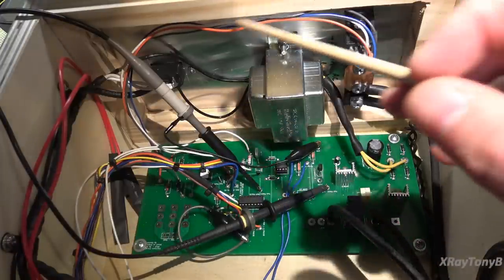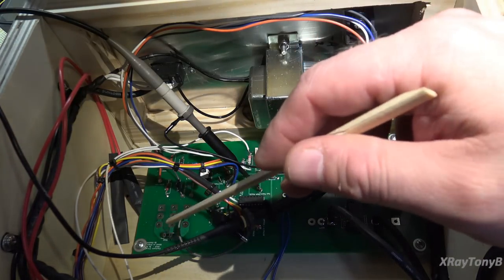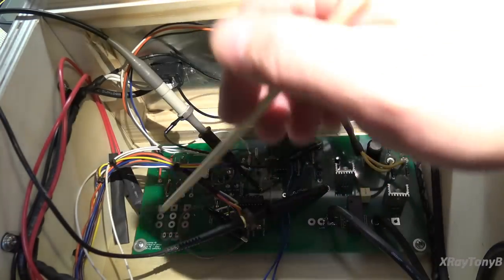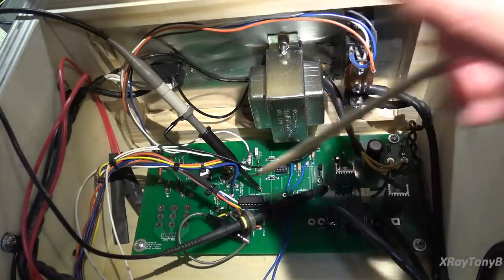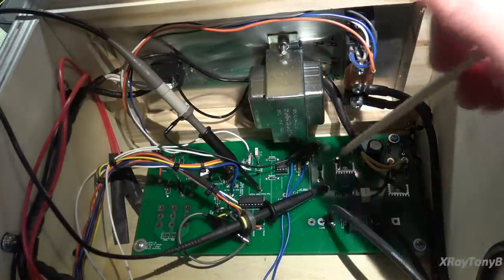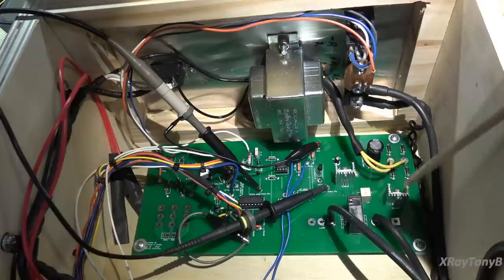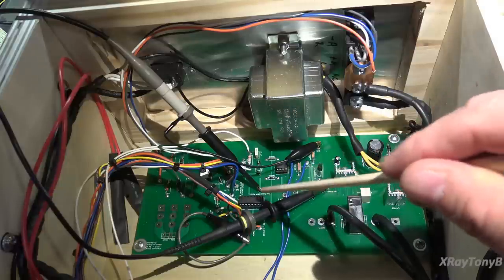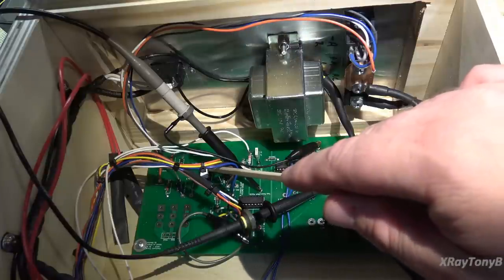These are the signal wires going back to the logic board. I modified this logic board — the latest revision is a little different yet to accommodate a couple of mistakes I made on the board when I had it printed. I put the option in here to use a triac so you can wire a triac in and kind of rewire things by making some jumpers, rather than the big power packs if you want. Here's our current sense module, and our voltage regulators are over here with that little 5-volt voltage reference, the LM358, the CD4040, and the MOC3163 optoisolator.